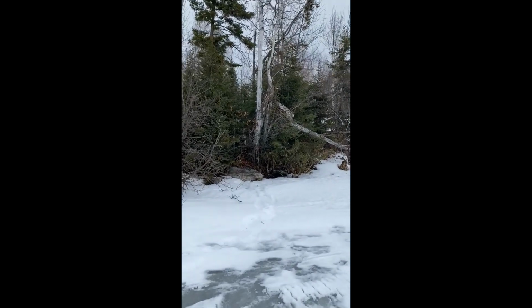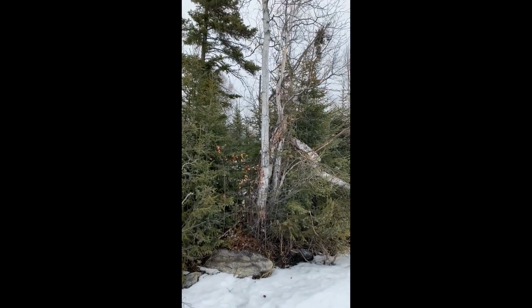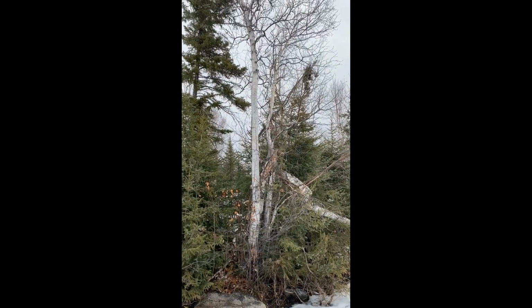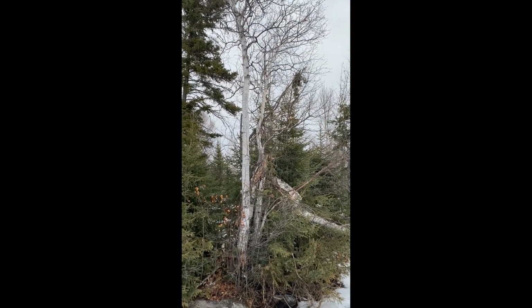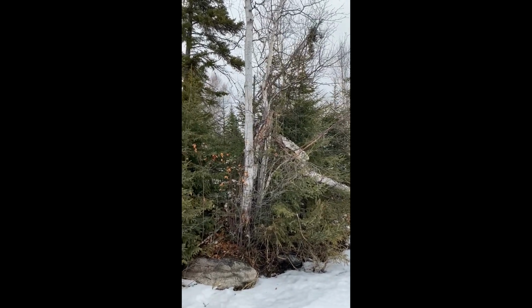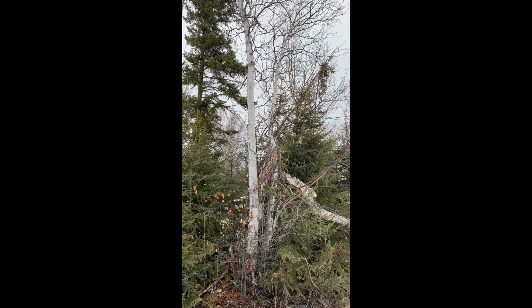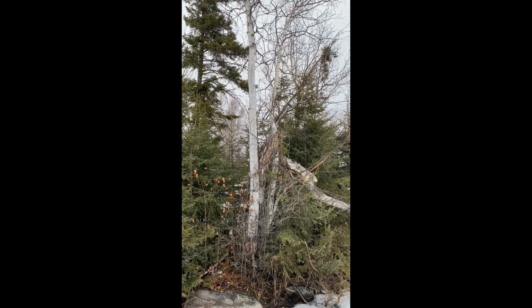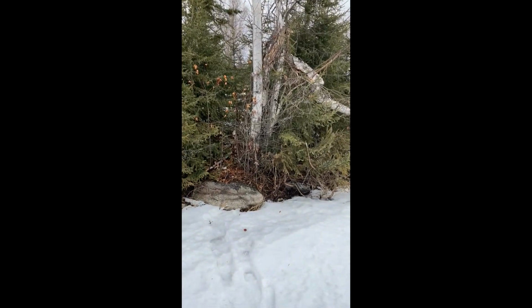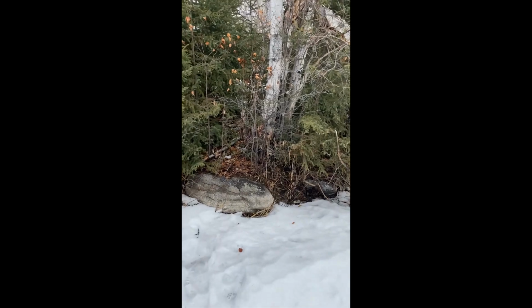I do believe we found one here. What you gotta look for is a straight tree with no branches, hardly any branches. So when you do the framing and bending, it'll be easier. Won't have a place for it to break. And you need a lot of moisture, so this one's real close to the water. It looks like it received a lot of moisture last summer.